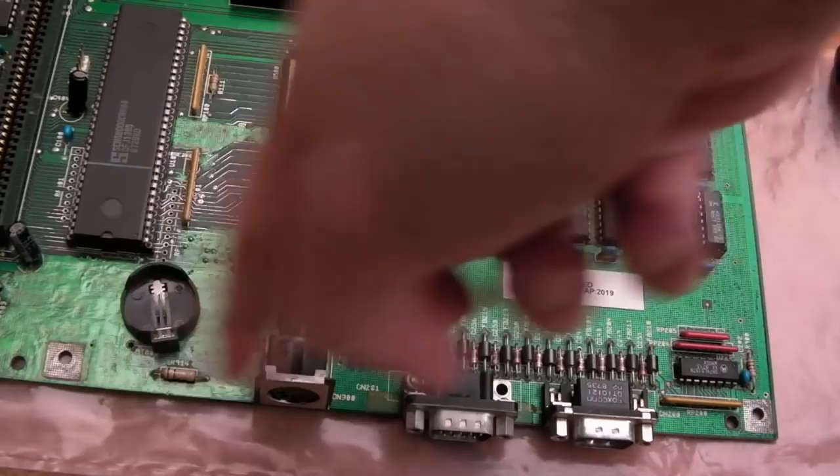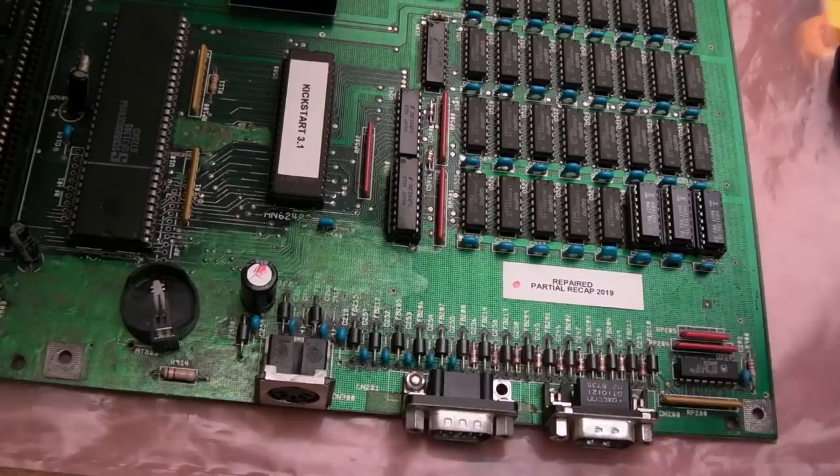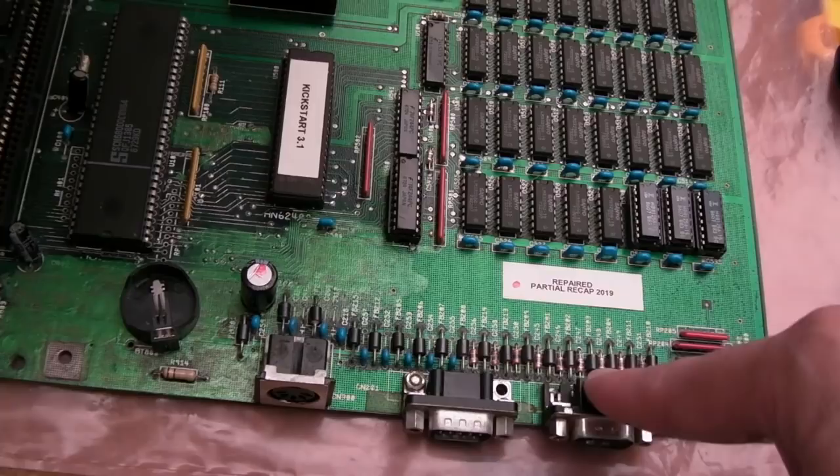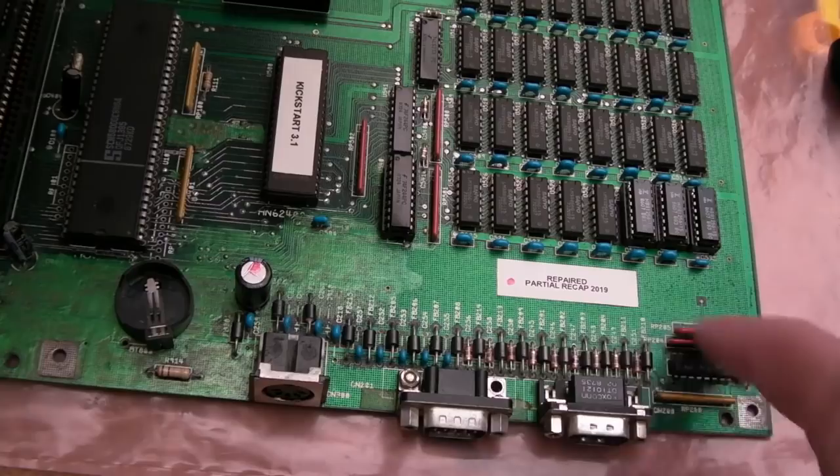The thing that I still don't quite get, and this is what always confuses me when I get a fault like this, is you saw that when we took the port off and we removed the resistor array, I'm sure we still had that 120 ohms measuring somewhere on one of these pins, and that was with the cap off as well. So I don't know at what point that disappeared. I just cleaned around here a bit more, toothbrush around here, maybe there was a separate issue here.